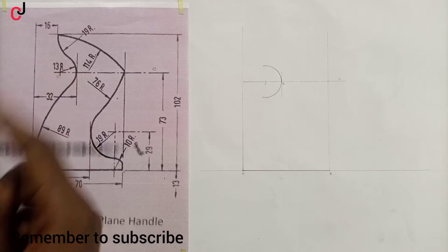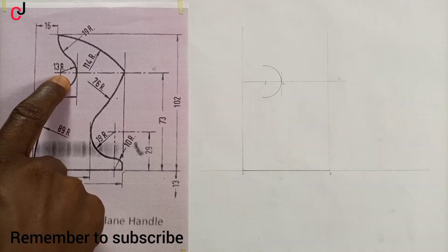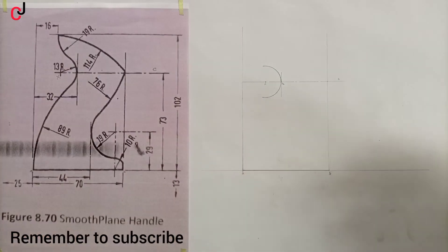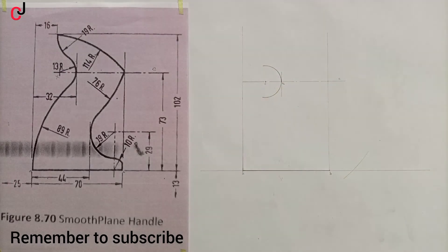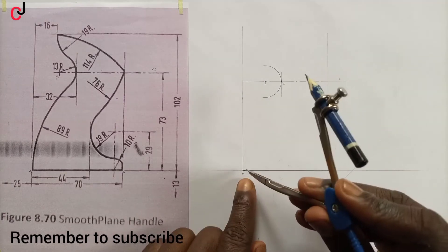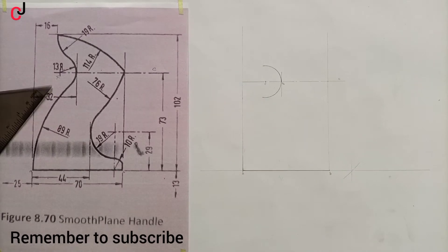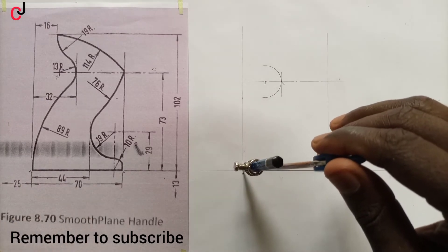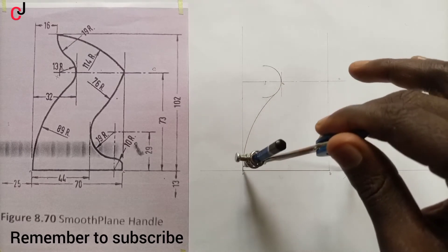When circles touch each other externally — one of the principles of tangency — we add the radii: 89 mm radius plus 13 mm radius gives us 102 mm. From our ruler we pick 102 mm, place it at point X, and scribe an arc. We also pick 89 mm radius, place our pin at point A, and bisect the arc. Using the point of intersection with 89 mm radius, we draw an arc touching point A and the circumference of our circle, stopping when it hits the circumference.